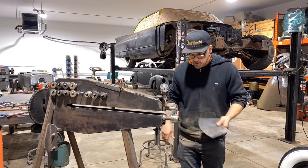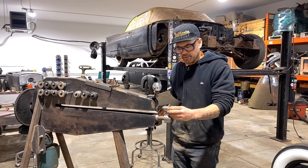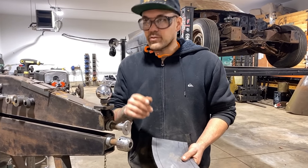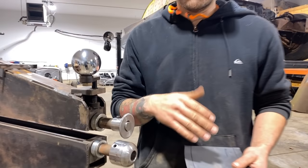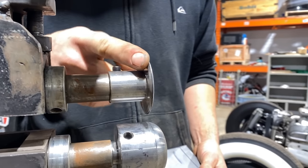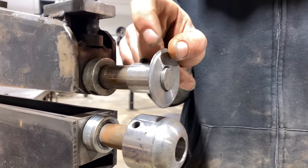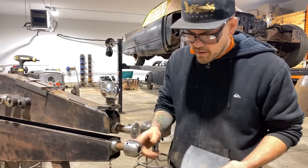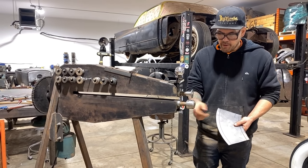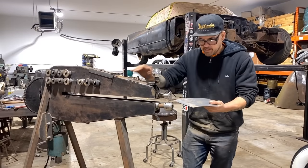Here we go with the bead roller. This top wheel — you can see it's a little sharpened with a point — is called a tipping wheel because we're trying to tip the flange. I also use this wheel for making patterns like the diamond tufted pattern, using a rubber wheel on the bottom. It came in an Eastwood forming die set. It was originally flat on top so I did sharpen it up a bit. Some guys use a skateboard wheel on the bottom but I like to use a hard flat wheel.